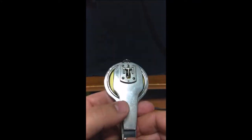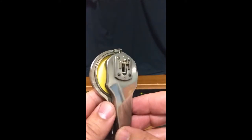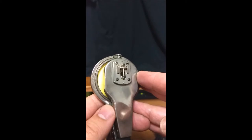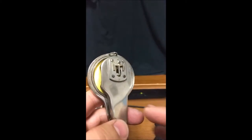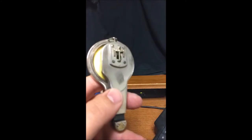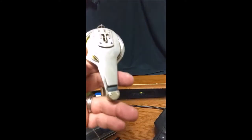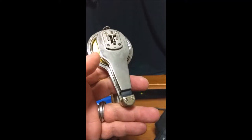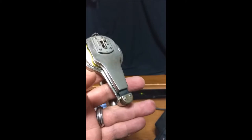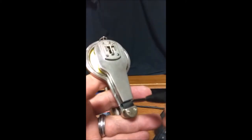The reason we're making this video is just to show you how to check your reproducer, tighten it up, and clean it up to see if you can make it sound just a bit better without doing a complete rebuild. So I'm not going to take this apart — I'm just going to basically point this out and show you the steps. You're going to remove these two screws for the spring.